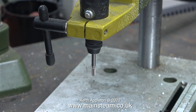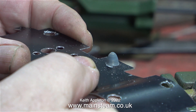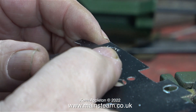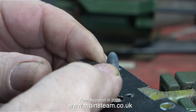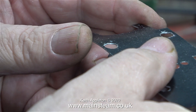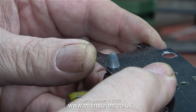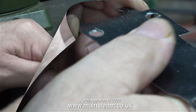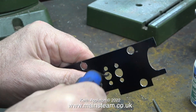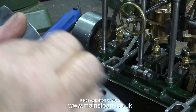Four holes — two at each side — and some 7BA brass bolts will allow me to fasten the part to the cylinder. For the final sizing of the holes I'm using a very useful grinder fitted in my bench-mounted Proxon motor tool; it makes the holes precisely the right size and now in the correct position. Once all the holes were in the right place and the right size, I used a deburring tool to clean off all the burrs — these are really useful and essential workshop tools: a blade that rotates in a holder and you just spin it around to clean off all the burrs.